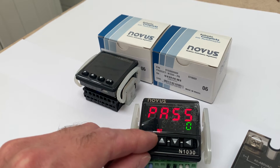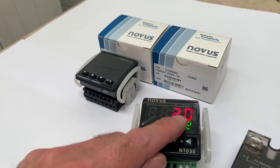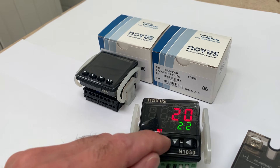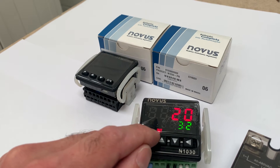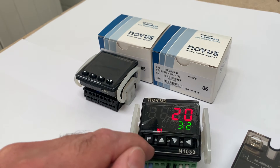I'm going to press and hold again until we go all the way back. And you can see we've got our measured value, process value, and our set point down here. Set point — simply up and down. Our output light has come on, and in this really basic form it's going to act as an on-off controller.